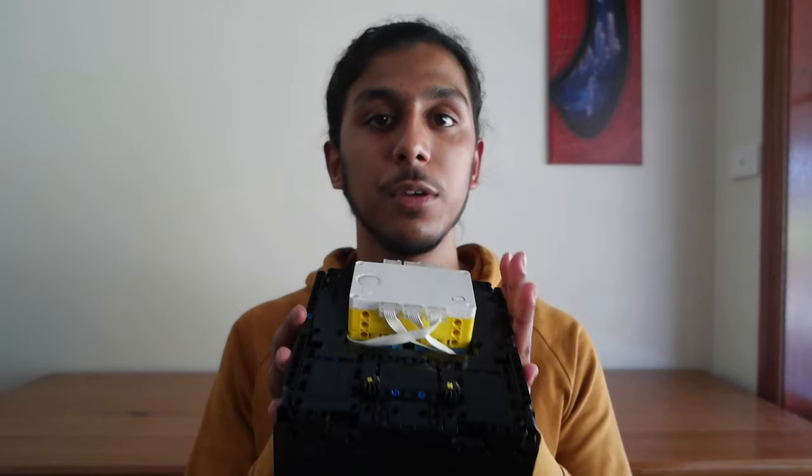If you didn't have these dog gears sitting on top of your frame, you'd have to connect all of your motorized attachments directly to the attachment motor, which is going to be very cumbersome during the game when your technicians have to take out and put in pins. As you know, connecting things with pins directly is a very tough process. Under time pressure and stress this is almost impossible to do effectively and efficiently. Thus the dog gears are very helpful when it comes to solving many missions quickly and reliably.